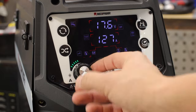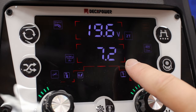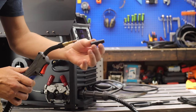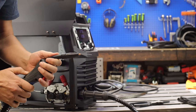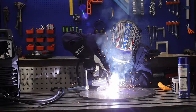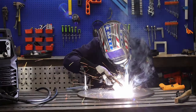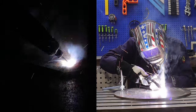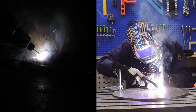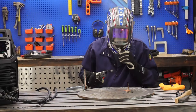Within that Synergetic setting you can also change the voltage offset, and it was welding pretty good as is. A couple things I'd change: when running in manual mode the output is in meters per minute, so inches per minute would be nicer. Also, it would be a cherry on top to include a flux core nozzle. I started testing on eighth-inch flat coupons at around 110 amps — too hot — dropped down to 90 amps for the fillet T-joint, and those welds turned out beautiful.